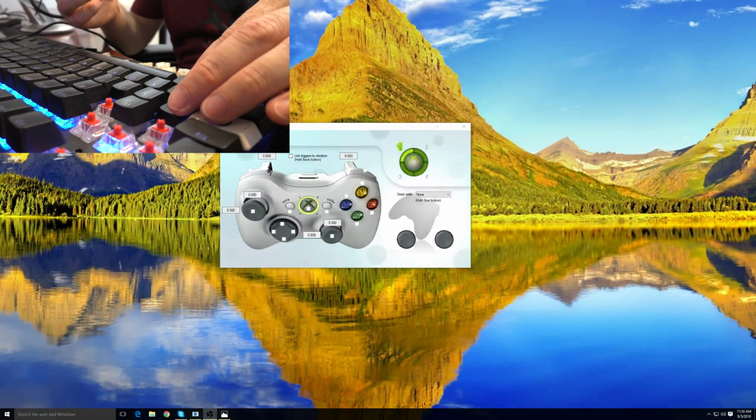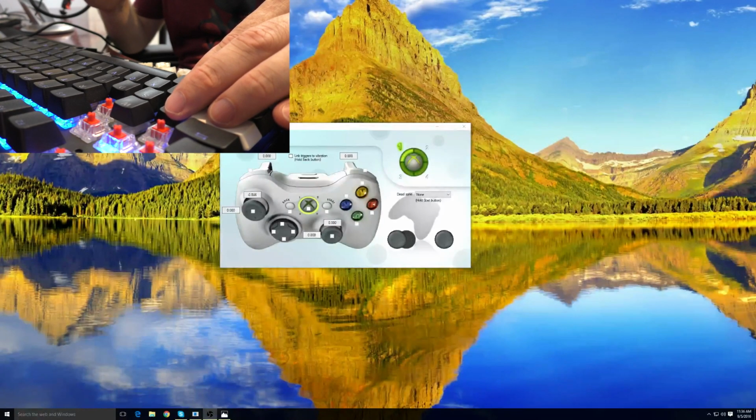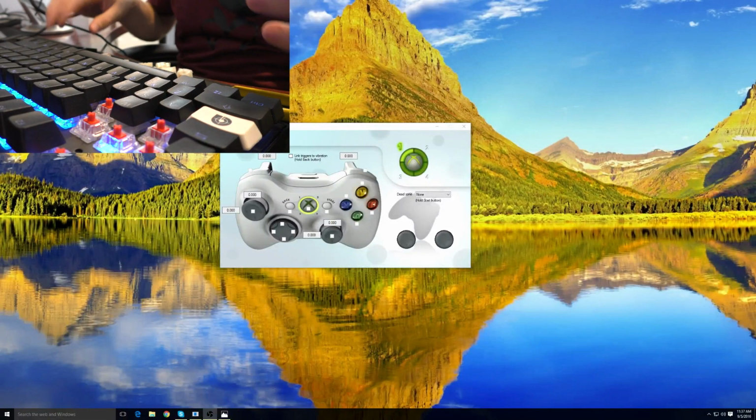This other one is the clear, and I have a similar type of response. I push it down a little bit, and it has pretty good response. You can see it starting to move, but there's that bump that's interfering with the key press, so I feel like I'm fighting that bump constantly in this area. Once I'm past it, it's fine. It responds in a linear fashion, but again, on the release and on the press, this area right here is really awkward. The last one is this brown one, and when I push it, nothing is actually happening, and I'll talk about why in a second. So that gives you an idea of what's going on with these ones.